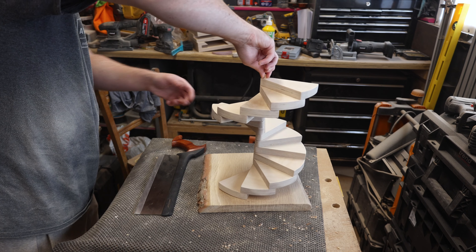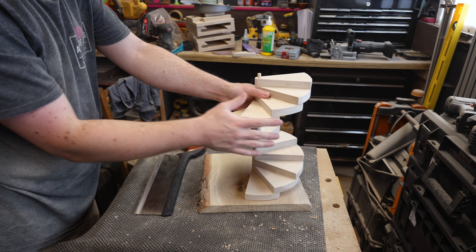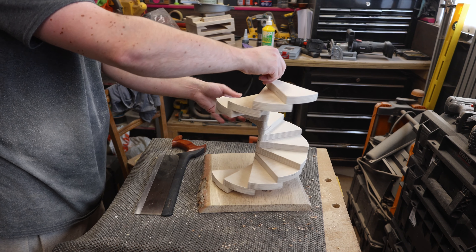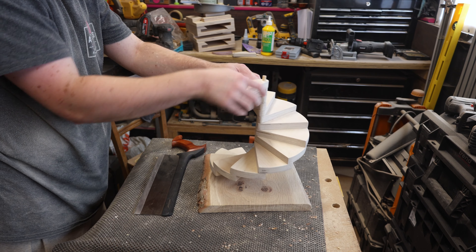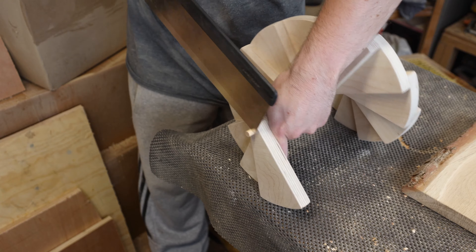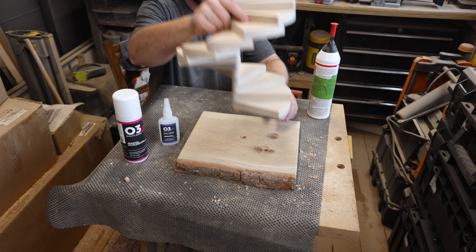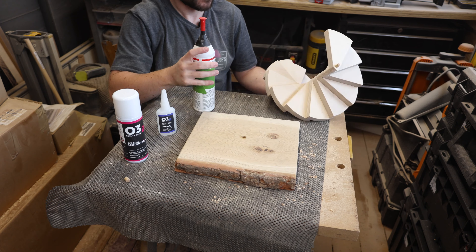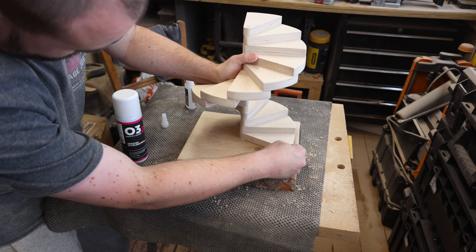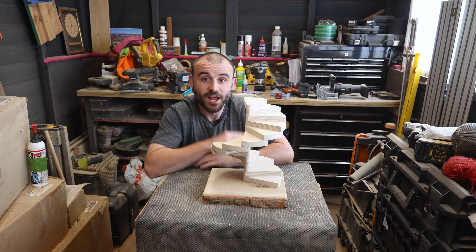The spiral is done and I'm really pleased with how it's turned out. I've eased the edges — sanded them since some were overlapping slightly — and sanded everything smooth again. I've also flush-trimmed the top piece of dowel with a handsaw. The last thing to do is glue it down to the base. I'm going to add some wood glue and also some super glue — the wood glue adds strength, the super glue sets fast, so you get the best of both worlds.